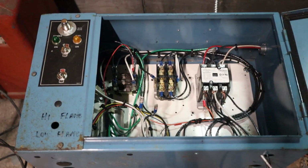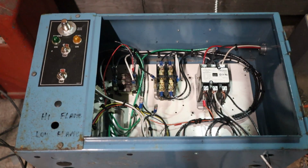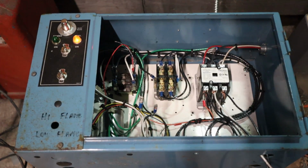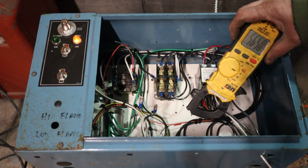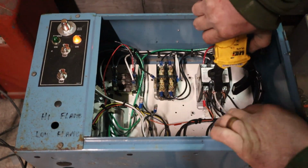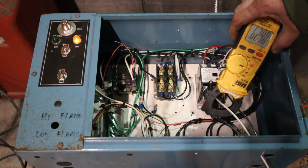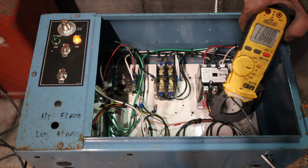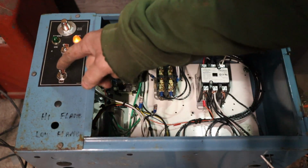that's what it is. Let's take this off. It's making too much noise. There we go. That's better. Alright, so we'll get the load going again. Now watch our amp probe. This is where it's kind of interesting. 5.9. 6.2. Look at that. 0.8. We're actually not generating enough voltage on that leg to run that motor properly without the run capacitors.